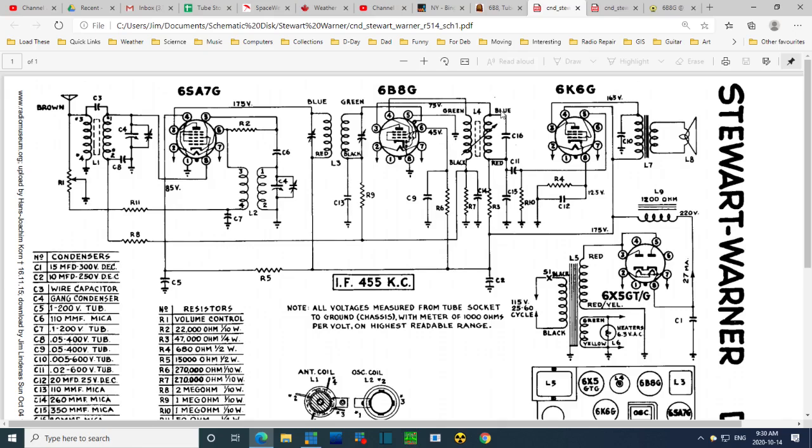The other thing I want to talk about is the tuning of this transformer. So if this is all about producing an AVC voltage, and the signal through here is going to be still loaded with RF. So C15 would be the signal ground for the bottom of the coil here. C15 is not terribly big either, 350 picofarads. C11, 0.02.